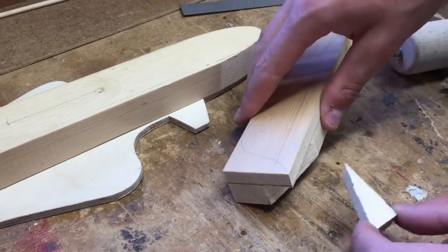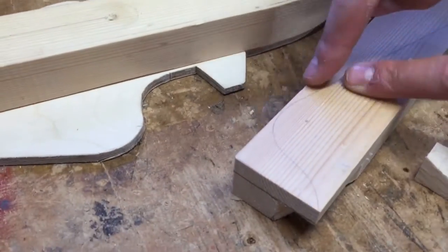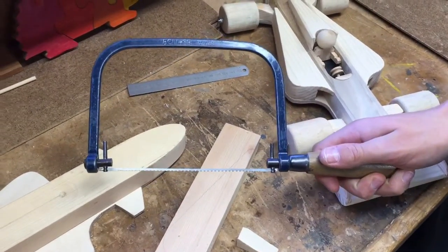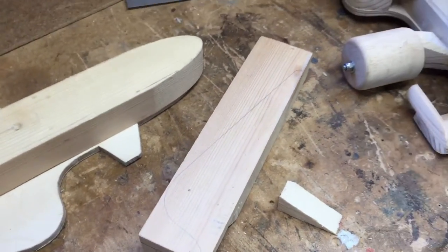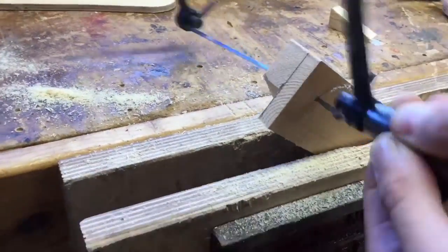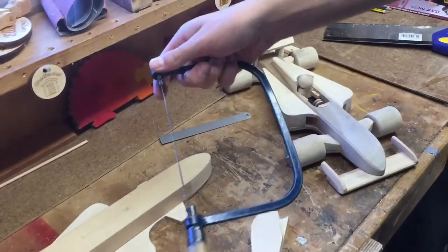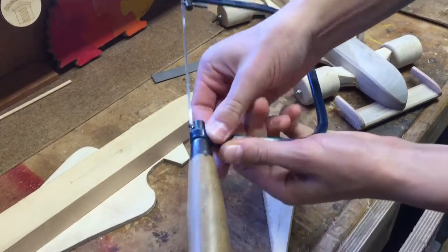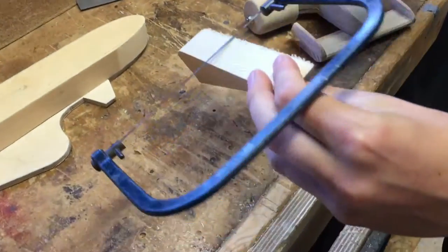So it's the shape you've got to cut out on the top — it's like a mini wedge. And then that shape there we're going to cut out with a coping saw, which looks like that. I'll come back in the next clip with that part cut out just to speed things up. I adjusted the coping saw by turning the blade anti-clockwise, moving these two little nubs, and then tightening the blade clockwise with the handle, then cut around it like that.